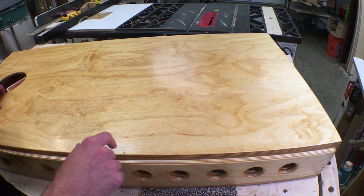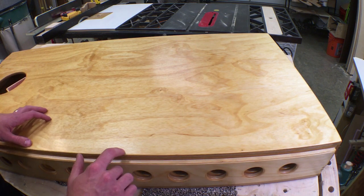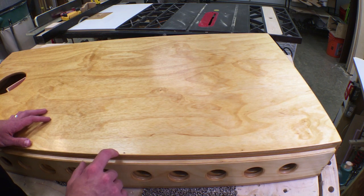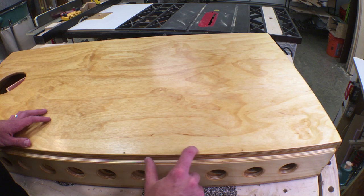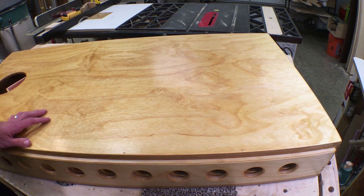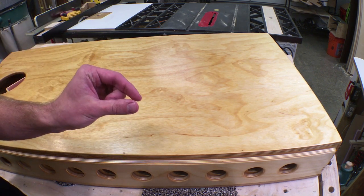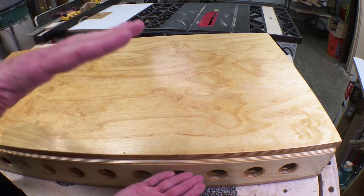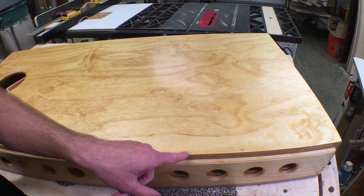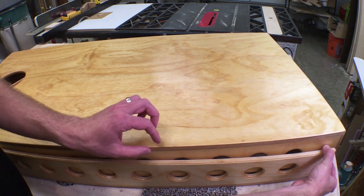The last item is to think about how you want to attach the top to the rails. You can do screws, but that will add quite a bit of weight. We chose to use wood glue and brad nails. On some sets we did finish nails, and if I was to do it again, I would just go with finish nails. The slightly bigger head on 16-gauge finish nails really slams and clamps it to the rail down there, creating a nice, good glue joint.